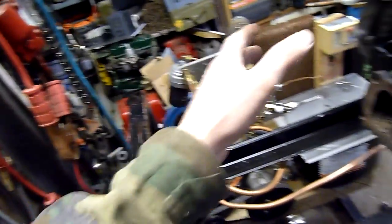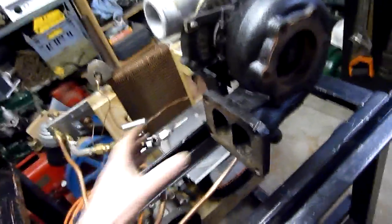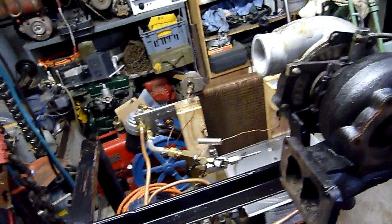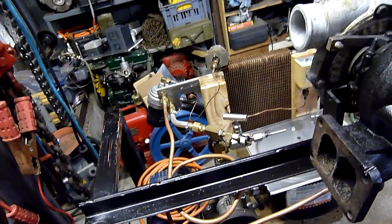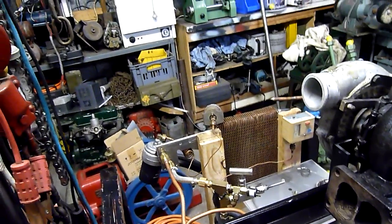The combustor is going to be out here when I build it. That's going to be the next big thing. First thing I want to do is stuff an air inlet into the exhaust turbine and just spin it up with oil flow going through it, see how well it fares. After that, we'll look at building a combustor, and I'll introduce some LPG, then eventually fuel oil — or Jet A1. Should be pretty good.